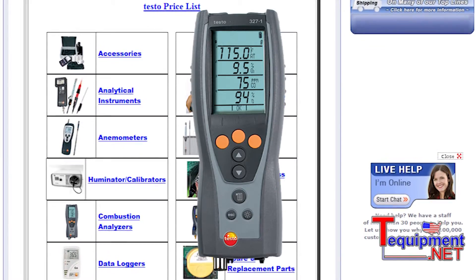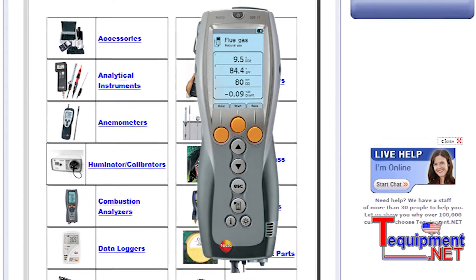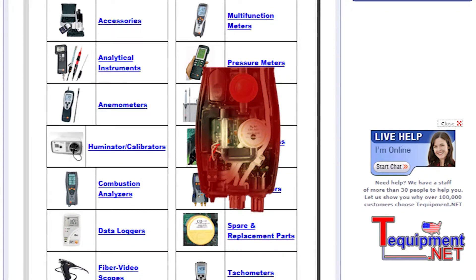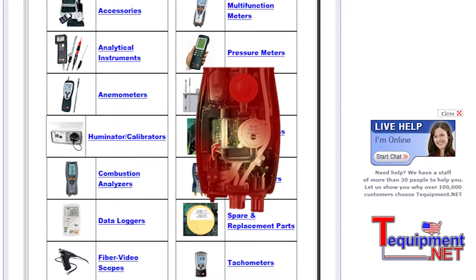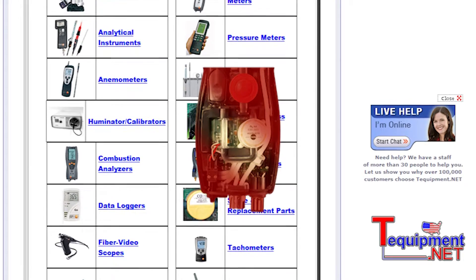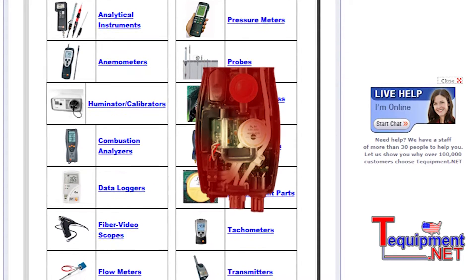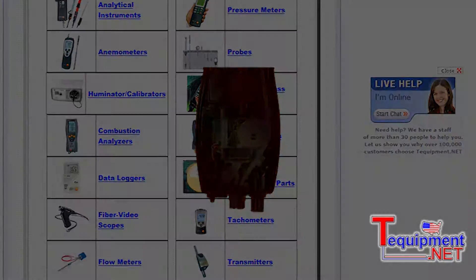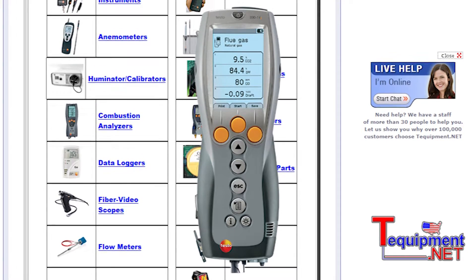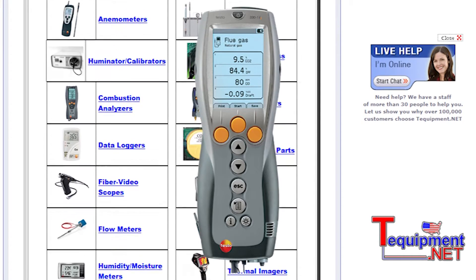To understand the differences as we move up from the 327 to here, there are two primary differences. One is we've got the ability to make this a NOx analyzer. There's an open position here, so we can drop in an NO sensor. We can put in an NO2 factor so that we have a calculated NOx value. So in places like California and other places where they're concerned about greenhouse gases, this is becoming more of an issue. If the person may not need that now, they don't need to make that investment. The upgrade to the NO sensor is about a thousand dollar adder. When they do need to have it, it's an easy drop-in plug-and-play sensor. The other nice thing about this product is that it has memory, so we can store up to 200 separate readings or tests of the boiler. So all of those measured parameters that we do, we would have 200 sets of those tests stored into here.